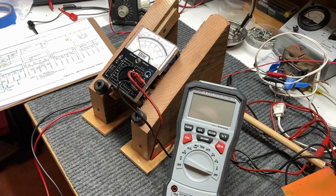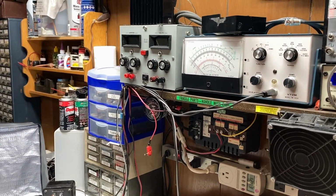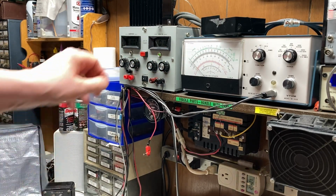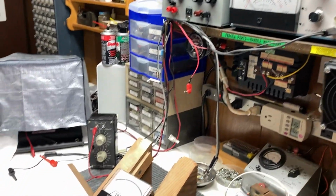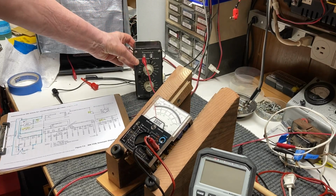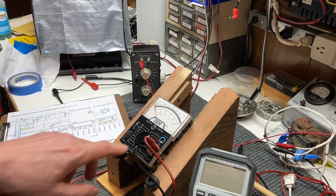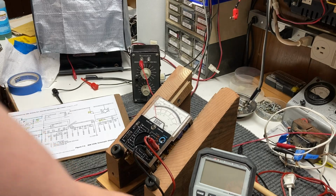And what you'll need is some kind of a direct current source. And I have one here. It's on my bench. It's up here in the corner. It's this DC power supply, and it's 1.8 to about 30 volt DC. Now, that's quite a range, but what I have to do after that is, in series, I have a Heathkit resistance substitution box, which will lower the DC current down to the lowest reading on the dial here of 0.6 milliamps, which is 600 microamps.